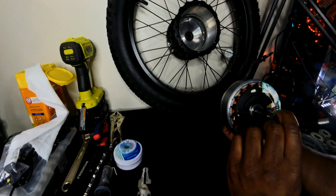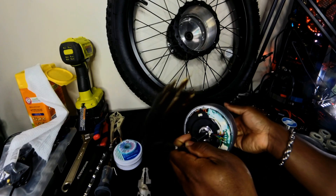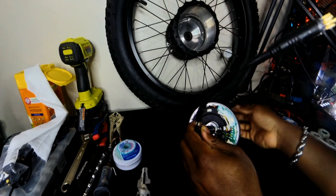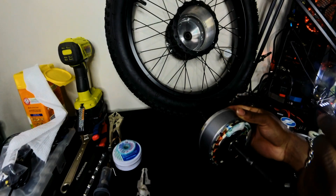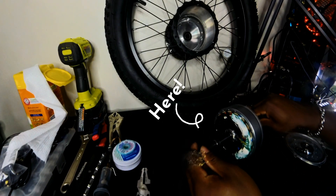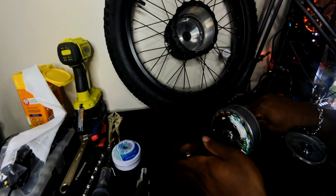The time is now y'all. Normally if you have an error 24 on your display, all that means is that something's not connecting via the harness pins — maybe you put them in the wrong way or something came loose along the way. Just make sure you follow the arrow orientations on the harness and that should fix your issue. If not, then you're most likely going to have to take apart the hub motor.